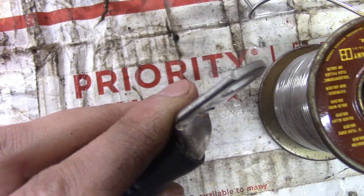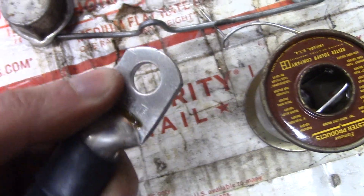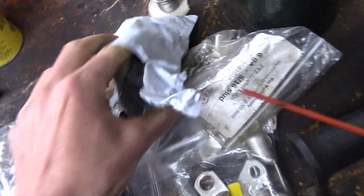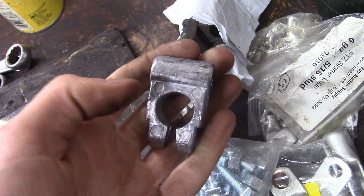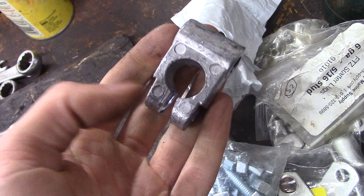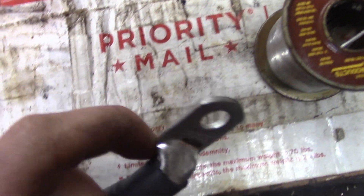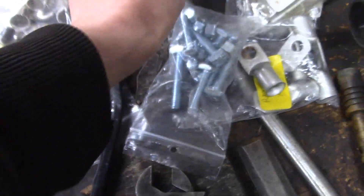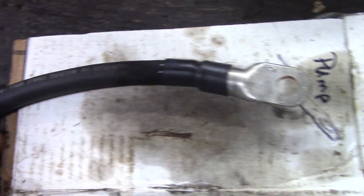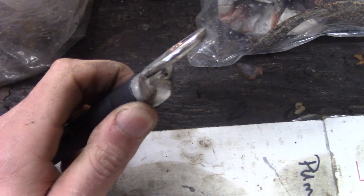Be aware there are shitty terminals and good terminals out there. I put two different ends on this cable - the Bay Marine terminal on one end and an Amco on the other. The reason is that one end gets bolted onto the battery terminal with a military-style battery clamp, so I wanted the thinner material there to avoid stacking up half an inch of connectors. The other end is a ground cable going onto the engine block, so I wanted an extra heavy-duty terminal.